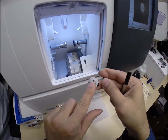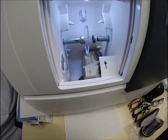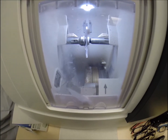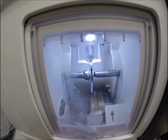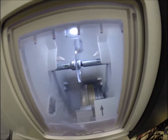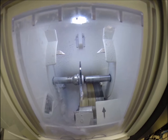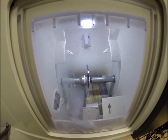I'm going to go ahead and put the lens in — the magnet is going to do its job a second time today. It's going to attach itself to another magnet there in the chuck — or as I like to call it, the Charles, because I don't know this machine well enough to call it chuck. I'm going to hit the green arrow, which is started in every language. The door closes, the clamp shuts, and then the lens is going to be traced by two white styluses, making sure that it's large enough to fit into the frame. You can see it just go around tracing the shape. The old carpenter saying: measure twice, cut once. It's measuring the thickness of the lens at every point to know exactly and precisely where to place the bevel, so you have the least amount of edge thickness showing. If you see light flickering in the background, that is water to catch the optical sawdust as it comes off the cutting wheel. Polycarbonate lenses cut dry, where plastic, high-index plastic, and Trivex cut wet, meaning that water sprays onto the lens for the duration of the cutting cycle.